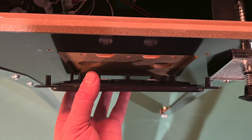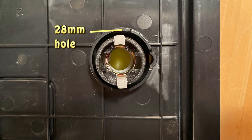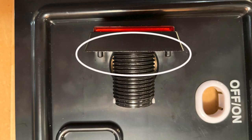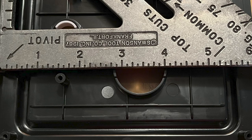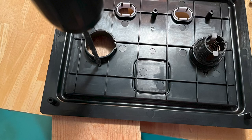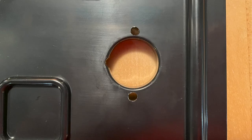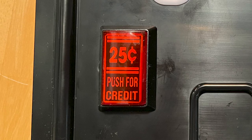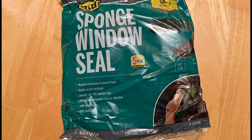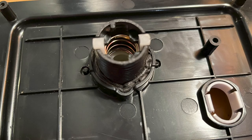The molded plastic coin door is held to the front panel with four screws. I removed the door and then tested the coin buttons in the holes. The coin buttons have a 24mm shaft, but the holes in the plastic coin door are for 28mm buttons. The coin buttons' alignment pins fit just to the outside of the molded sleeve in the door holes. I used a square to mark the vertical center line, then drilled holes slightly larger than the pins directly adjacent to the sleeve. After inserting the button into the hole, I used some sponge rubber weather seal, trimmed to size with scissors, to fill the remaining gap and hold the button tight.